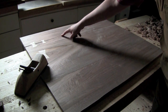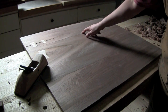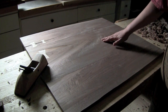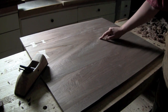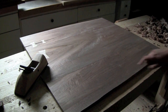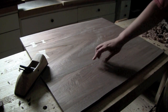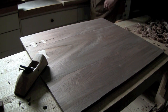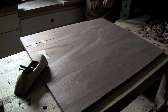I've got a little plane track right here that's popping out — there's a slight shadow. Got another one right here where there's a little bit of shadow. This center section I talked about before is just a little bit rougher, and what I've got is reversing grain in here, so I'll need to spend a little bit of time working on that. There are some plane tracks down here that I didn't notice before, but now they're cast in shadow as that light comes in from the window. So not only do you need to have raking light, but a lot of times you need to flip your board around and look at it from a couple of directions.